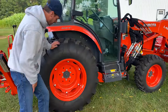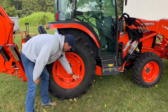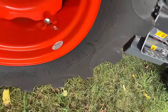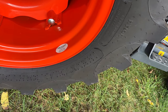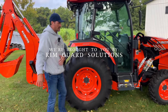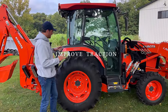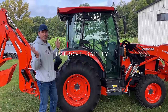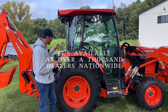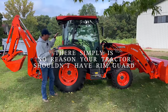Another visual clue: if you see a sticker like this that says Rim Guard — kind of an oval sticker — more than likely there's Rim Guard, or beet juice, which is liquid ballast filling those tires for a lot of extra weight. We're sponsored by Rim Guard for good reason — every tractor needs ballast weight. Liquid ballast is out of the way, hidden, and adds hundreds and hundreds of pounds. There's probably seven to eight hundred pounds between both back tires, which gives you a lot of counterweight back here to stabilize you when you're lifting weight with the front end loader.